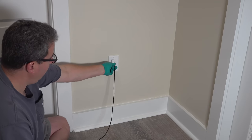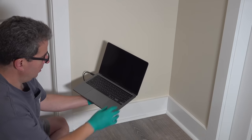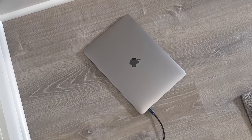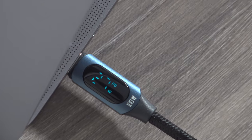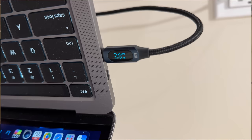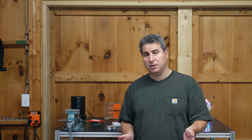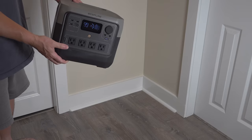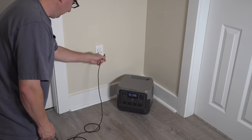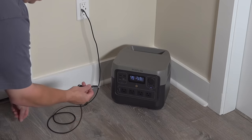Now we can go on to test out the USB connections. First I'm going to try plugging into this MacBook. This is an easy test but unfortunately I can't monitor exactly how much power is going into the notebook — but there is one trick I've got. This cable has a small LCD display in it that's able to show me how much power is going into the device. It's getting around 37 to 40 watts. For this model MacBook that is a regular amount of wattage that it would use, so things look like they're working pretty well. But I want to see this thing putting out the full 60 watts, so I'm going to use this EcoFlow River Tube. Normally you're using these to power other devices and it does have a USB-C outlet rated for up to 100 watts.